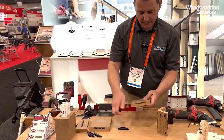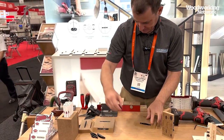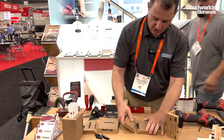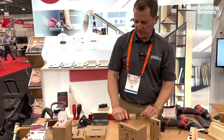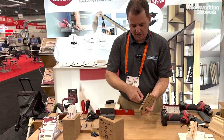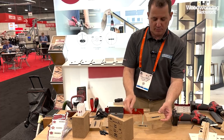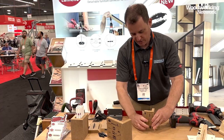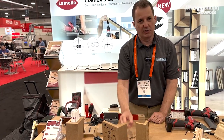Now with this slot, the P-System family of connectors slides into that pocket. This one's called Tenso — it's designed to work with glue for mating halves, so miters and complicated joinery are really easy. The other new product we're introducing is the Clamex S20, which works on the same principle except it uses a 4mm wood biscuit slot. It has a little internal cam lock, so using any wood biscuit joiner you can make knockdown assembly and clamp joints really easily.